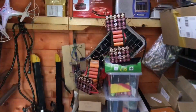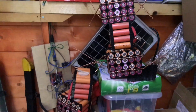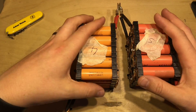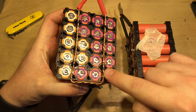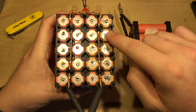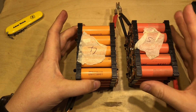The shed is such a mess and these packs are worrying me sat up here on top of all this junk, so I definitely need to get these mounted to the wall. In a previous video about these packs I got to the point where I'd fused each cell and connected it to my bus bars, and that seemed to work quite well. I did the same on the negative side, and a few people commented — yes, I am fusing both on the positive and the negative sides. I'm a belt-and-braces type of person.